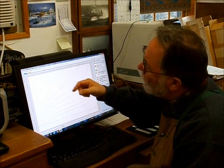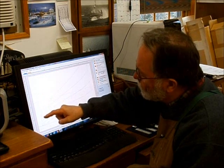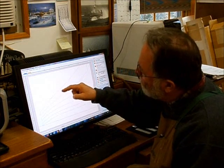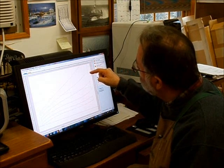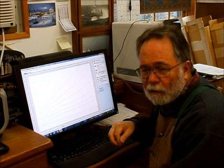And also I had to cut away the male to make it a little shorter on the ends than the female, so that they fit together, because when we route out the female, they're going to have rounded corners, and I didn't want to get hung up on those rounded corners.